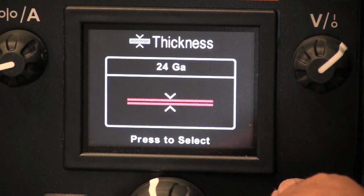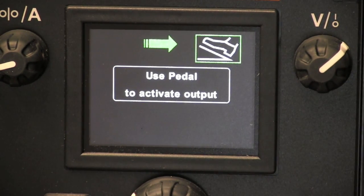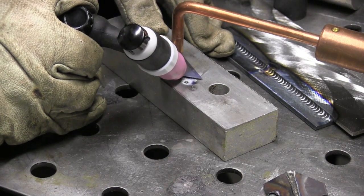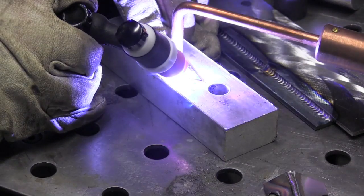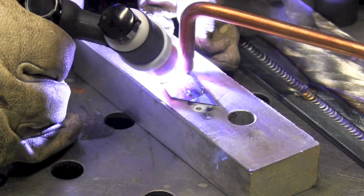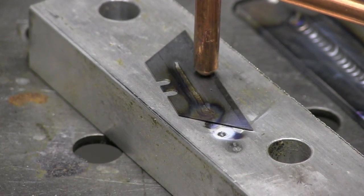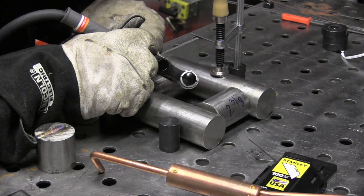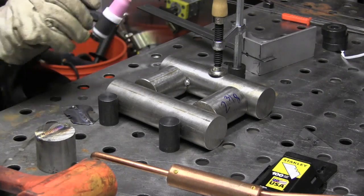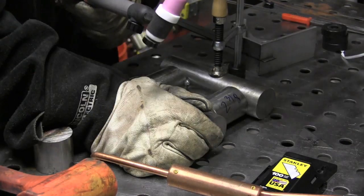Let's swap things up here a little bit now and test the ability of this machine to light up on pretty thin stuff. I'm going to leave the 3/32 electrode in there but set it up for a 1/16 electrode so I have a really low start and we'll see what happens. It's trying to stick a little bit and doesn't have a real crisp start. I just want to see if it can start up on thin metal without blowing a hole. I've got a 0.025 inch thick box cutter blade here, and I just wanted to see if I could start up on it and run a bead without blowing a hole. Not bad. I had it sharpened up like a needle, and with the foot pedal you've got quite a bit of control. I've seen other videos where without a foot pedal it had a little bit of a blast of amperage at low amperage, but with the foot pedal you can light up on some fairly thin stuff.